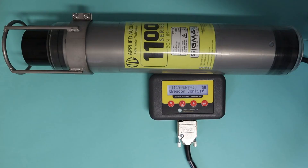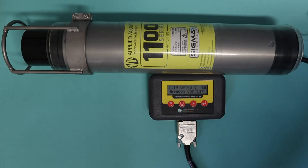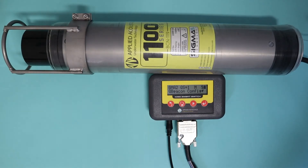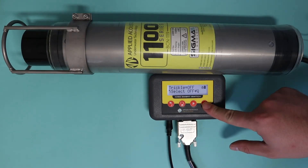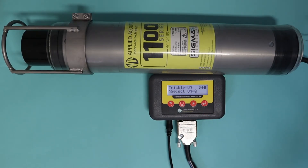Let's move on to charging. To use a 1082 as a power unit you're going to have to input mains power. Provided with every 1082 smart switch is a power block — it's a universal power block that can take 110 volts up to 230 volts and outputs 30 volt DC. For a trickle charge, plug this into the bottom left of the 1082. Cycle down to Trickle Charge, press enter — at the moment it's off, cycle to on, press enter again. It says selected and you'll see a little power icon on the top right.